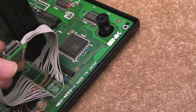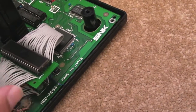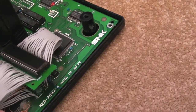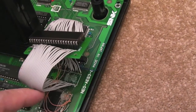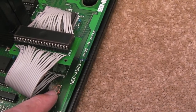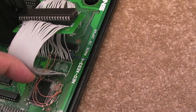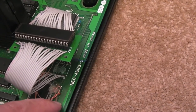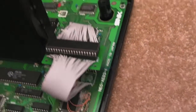Everything's exposed so it's easy to see what's going on. Look at the state of that - there's lots of bits stuck up. I've got these three orange wires here and there's like a socket still on there. I don't know why someone would do that - it's beyond me. I should be able to use some shorter wires because some of these are ridiculous lengths. And putting glue on there is always a good idea, but not on the chip like that - not on solder points, because that's a nightmare to get off. The best place would have been to pull these wires over a little bit and stick a blob of glue here, not on top of the chip or on the solder points.